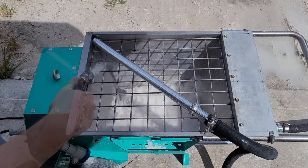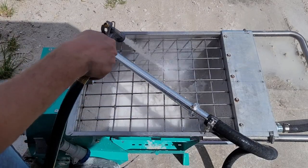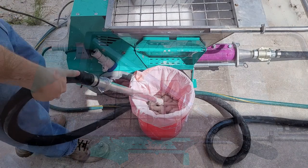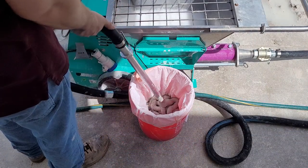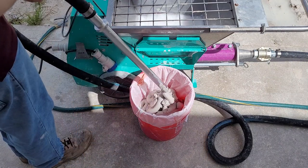If you are using a reactive material, such as cement, the pump must be fully cleaned right away after using it. The pump speed is set at 35 at the start of cleaning. It can be set higher as the pump is emptied of solid material.